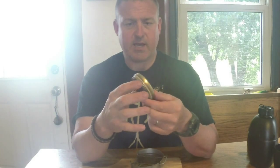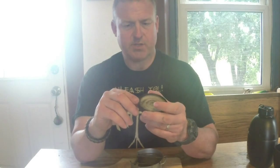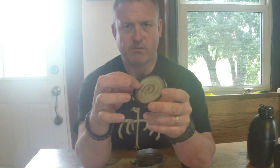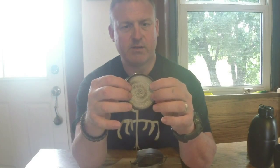He had used a shoe polish tin. I thought, well, that's pretty interesting. I have some of those laying around. And initially what I did, and how I've tested this in the field so far, was I took some fiberglass wick material and I coiled it up on the inside here. I actually took a piece of metal screen and formed it to the inside of the tin, and put that down over top, so it's all kind of encapsulated.